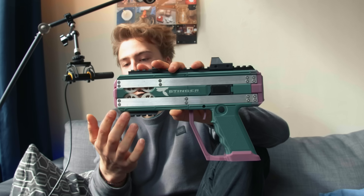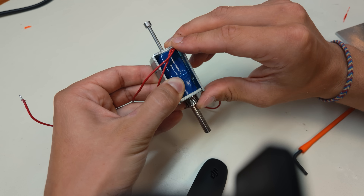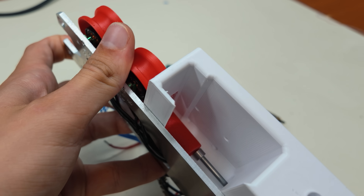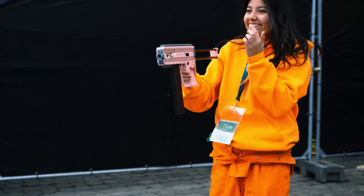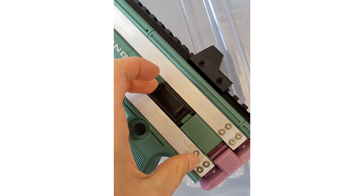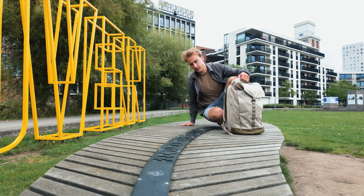First, I should probably explain the whole concept: the Nerf gun fires by spinning four drone motors really fast, then having a solenoid push the Nerf dart into the flywheels which compress the dart tip and make it shoot out. Version one was a very good proof of concept and performed really well, but it had a couple of weak points — one was the screen ribbon cable connector, which was quite fragile. The whole assembly process was not very well thought out. Also, people really wanted a mag release, so we can add that.